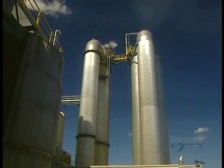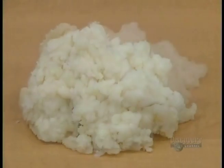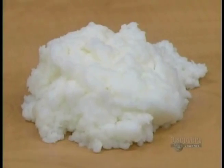With this spatula, they verify the quality of the brown paste washing. The paste must be bleached. This alkaline extraction tower places the brown paste in contact with chemical products. It's bleached with chlorine dioxide and gradually becomes more white. Then the water is partially drawn off.